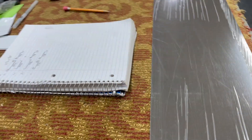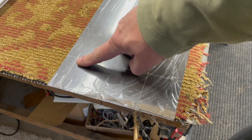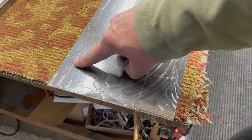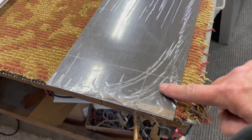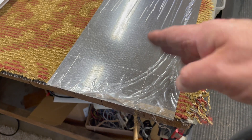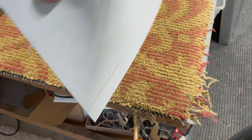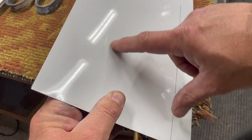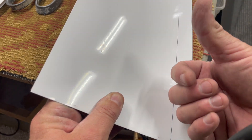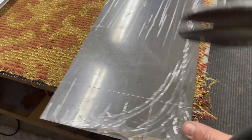I went ahead and scribed the two markings for the Z-metal. This is the three-quarter inch from the edge to here, and then this is the two inches that goes down — so this one comes up this way and this one goes down underneath. I scribed it here to cut it, and also scribed it underneath, past that two and a half inch mark, so I know where to break it. I'll cut these real quick and then move on to breaking it.